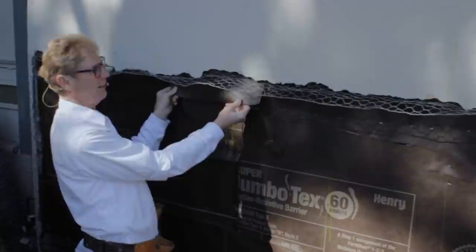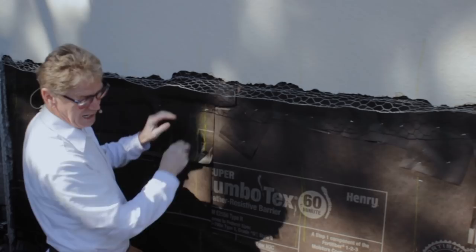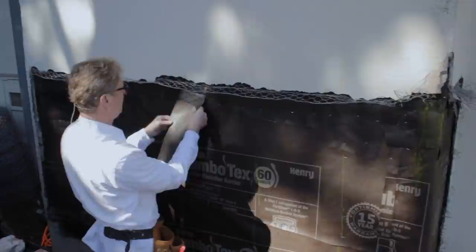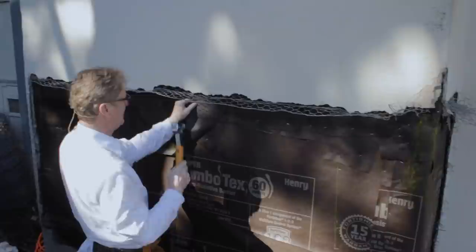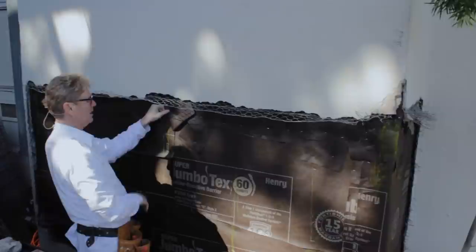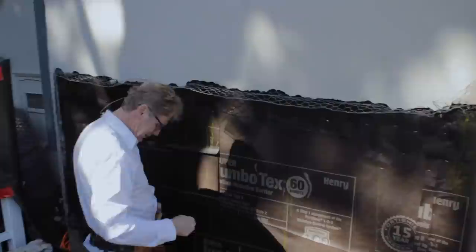The owner asked: what about the nails? Good question. Now this is under the paper, overlapping and held by the wall itself. Where there's a nail under the paper, you go this way on one side and then that way on the other side — now you're as far under the paper as you can possibly get. We make a V where that nail is. The nail's about right here, so we're good.